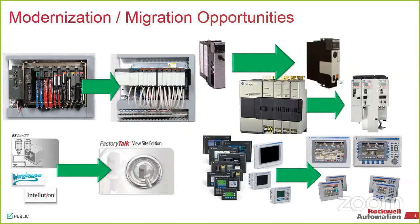They're not published tools like we've got for converting some of our PLC5 hardware, because those are published and have nice documentation and we can push out and let anybody use them. These ones are a little more rough around the edges, aren't as complete, but they're good for internal use within Rockwell. So we have those at your disposal. And then we've also been through a couple revisions of HMIs. So our PanelView Standard, PanelView Plus, PanelView Plus 6, PanelView Plus 7, all different revisions of that platform. And again, tools to migrate from one to the other, manuals to help with part number conversion, as well as manuals to walk you through the software conversion.